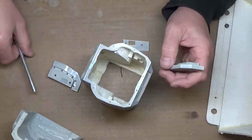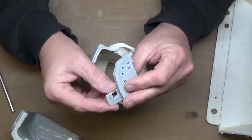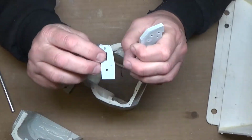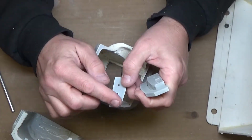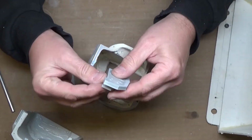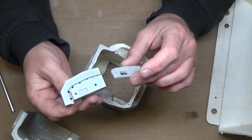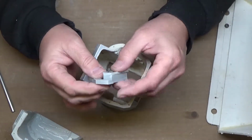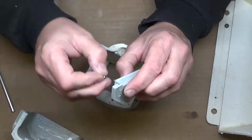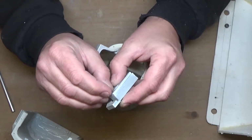Okay, I'm babbling along now. There's a left and right on this. The parts are cast up with a back flat, so the parts that don't have the tiny little air bubbles on them will be the faces. And these will get bolted with a 3mm bolt. You're going to have to open up all these holes also. The holes are drilled through. I did it on a drill press. If you have a drill block, that's good. Or just try to drill very, very straight.